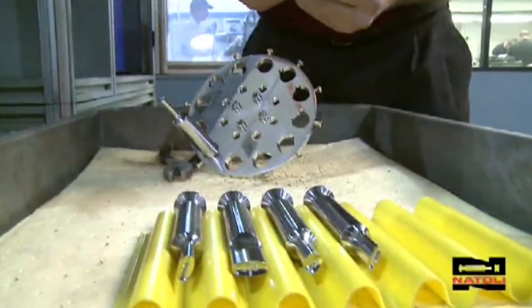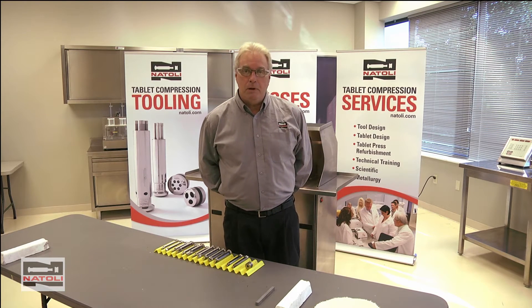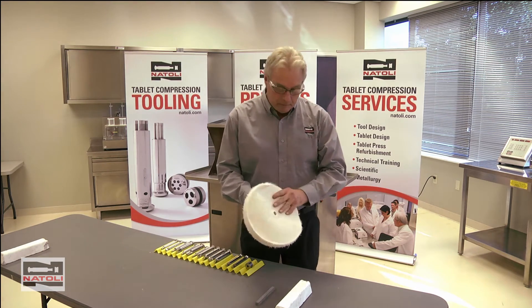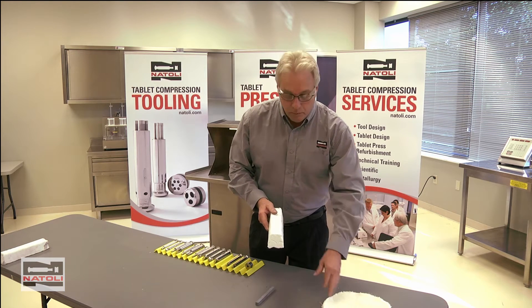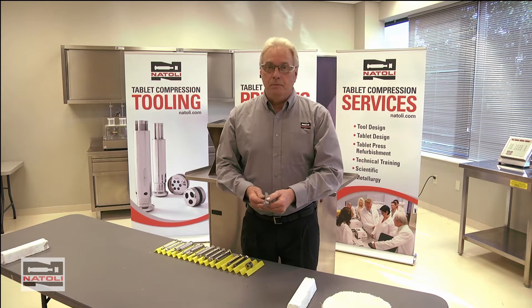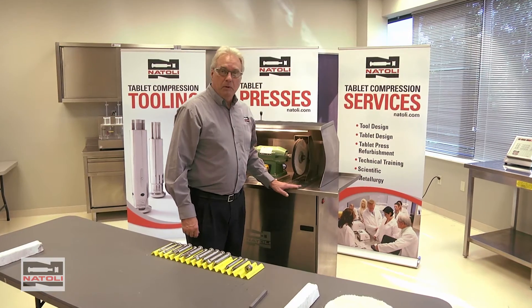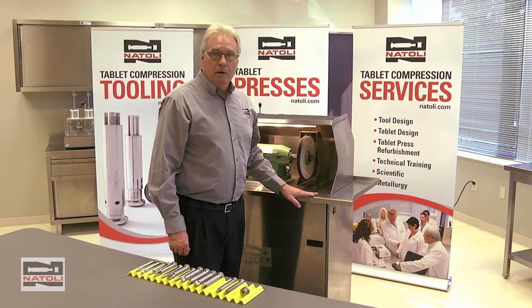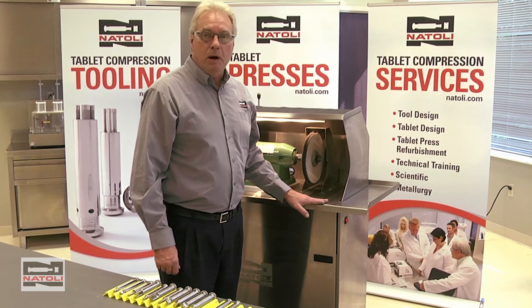Polishing by hand is the most recommended way of refurbishing your tool. The equipment you need is an unsewn cotton wheel, white polish and paste applied to the cotton wheel, a 400 grit stone, and a polishing unit. I'm going to show you how to repolish your tools, repair J-hook, and increase tool life — something you can do internally in your own plant with the proper training.